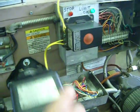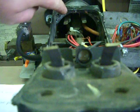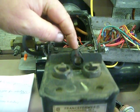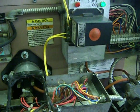Next we have the electric eye. This normally watches the flame up in here all the time. If you run out of oil, the flame up in here will get dim. You will lose the ohms coming back through this electrical cord to the flame controller, and it pops the red button. It shuts the unit down.